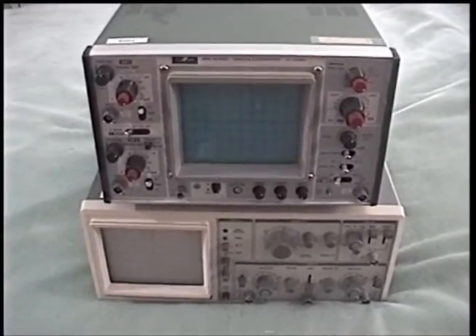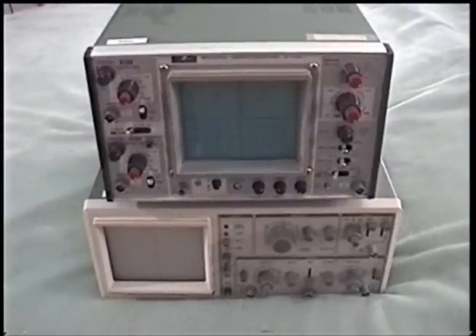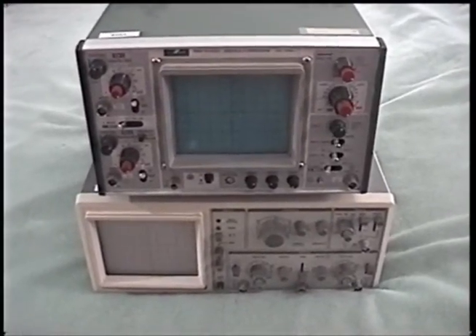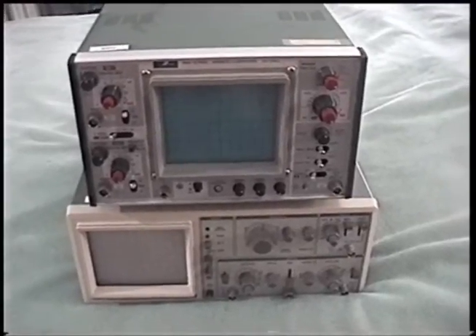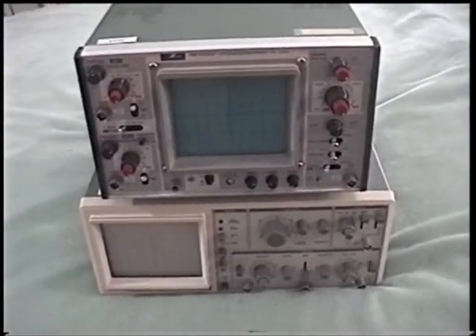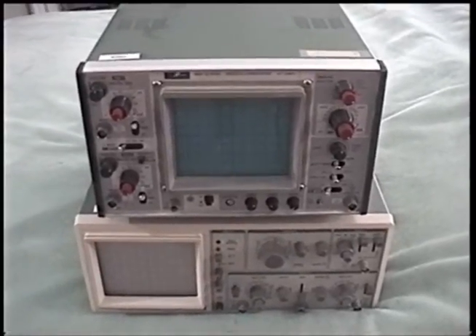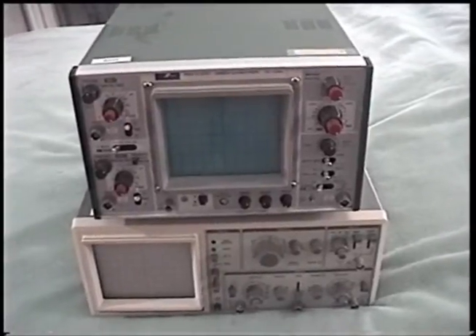The adapter isn't really an issue — it's just an adapter. As for the probe, it's a slightly more complicated device and there can be a difference in quality between cheap ones and good ones. The probe I got on eBay cost me about six dollars, whereas a decent probe from someone like Tektronix will cost like a hundred to a hundred and fifty dollars. But I read online — in particular on EEVblog — where someone reviewed these really cheap eBay probes and it turns out they're actually just fine. And even these cheap probes are rated up to 100 megahertz, while the fastest thing I'll ever measure would be the output of an electronic fluorescent lamp ballast, so at most a few hundred kilohertz — super slow compared to what either these scopes or that cheap probe are rated for.